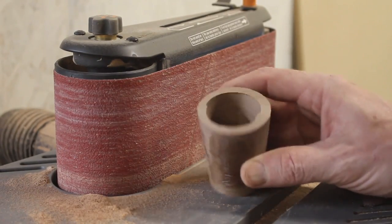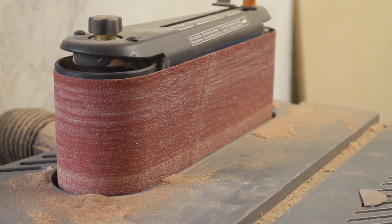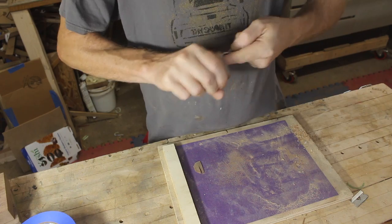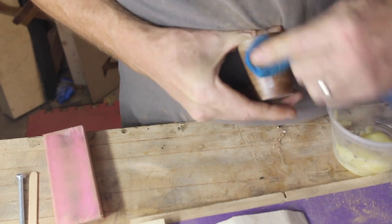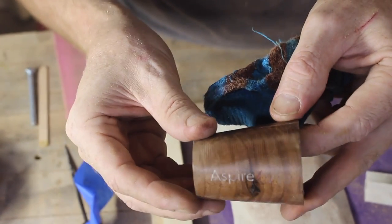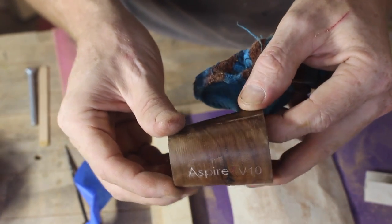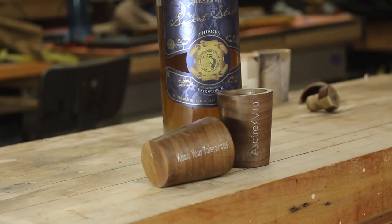You can see my half circles are still not 100% perfect but they're much better now. I think adjusting the speed and feed of the ball nose toolpath could help alleviate some of that problem, but everyone's machine is going to be different and you're going to know your machine better than me. I didn't go crazy sanding it - I just put a little beeswax polish on it and there you go. You can see that red is hard to see in there but it's there and I know it's there.